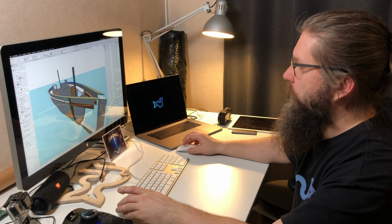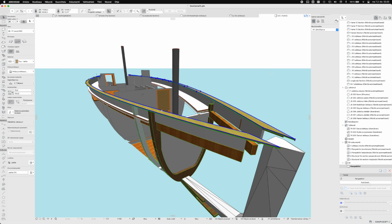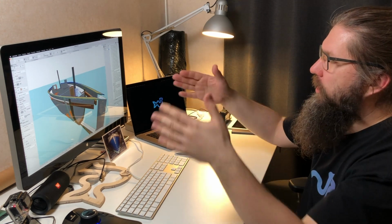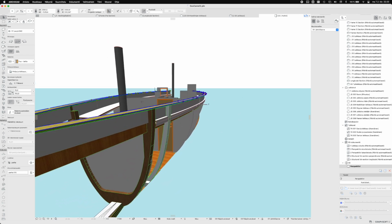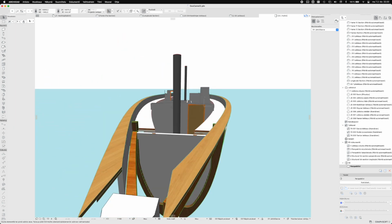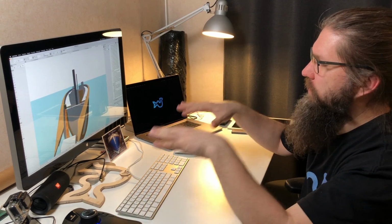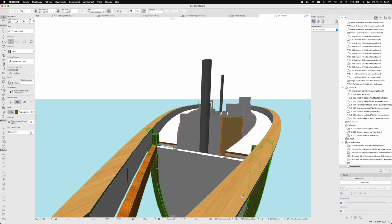But I will do a CNC machined structure from plywood when these are actually connected together in the middle from multiple points, so they should kind of click down and form the shape of the bulwark. And these are all now done in a way that these frames should fit perfectly on this shape. And then I just have to figure out quite a bunch of molds and temporary structures to hold everything against the shed floor and together, and how I'm gonna put these frames and stuff.